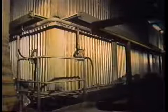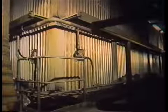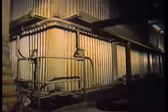The boiler casing, which is the outer steel skin of the boiler, is subject to those 5 common problems we keep seeing throughout the boiler: overheating, support failure, corrosion, problems in areas of prior repairs, and problems with construction welds. Some signs of overheating are burned or blistered paint. In fact, the casing may even get red hot.